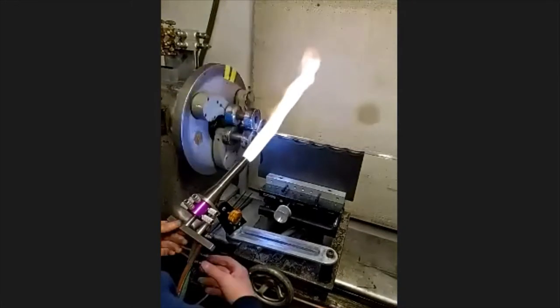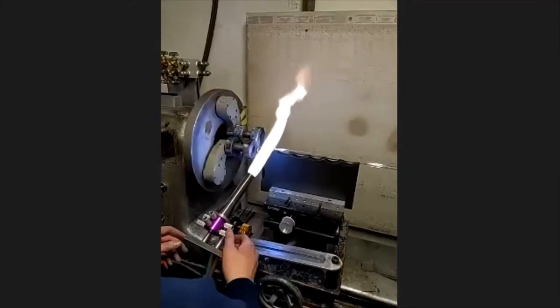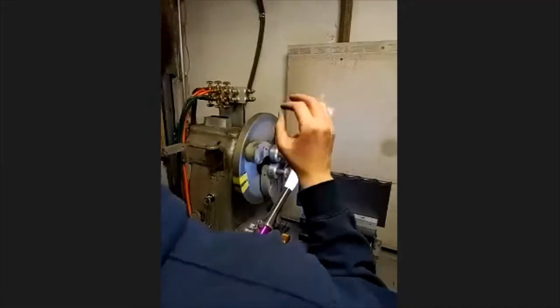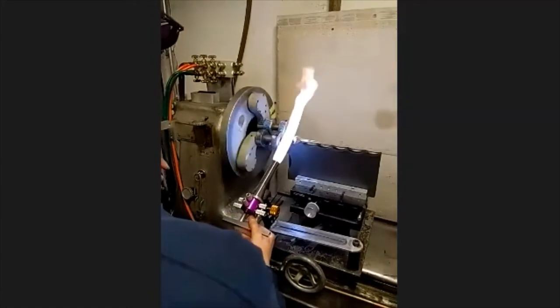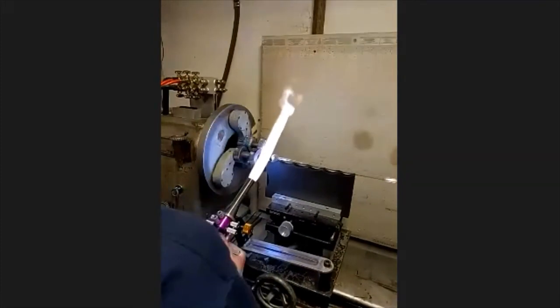So the first thing I'm doing is a rough gather to approximately fill the mold, and then I'm gonna do a second heat. When I want the glass to sit on the mold, I need to wait for it to all come up to temperature and then start shedding that heat before I let it touch the graphite. Otherwise, you're gonna see a bunch of hard lines in the glass after it kisses the graphite when it's too hot. Either that or I'll wrinkle it, destroy the bubble.